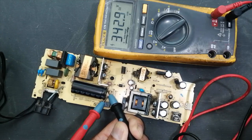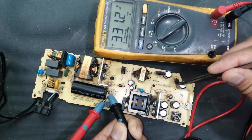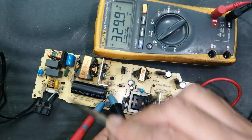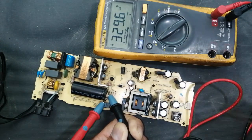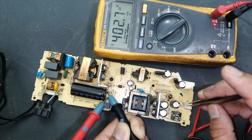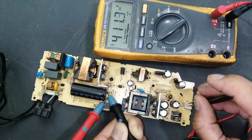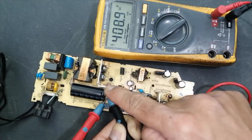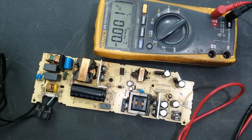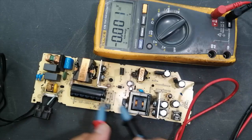Dropping — 370, 330 — because the PFC circuit is now turned off. With the PFC circuit off, we have no output in the 12-volt section. Only the standby circuit is working, and we receive the standard bridge rectifier output voltage. Now I will turn it on again. The PFC circuit started switching and it is now regulated at 411 volts — normally we call this 400 volts. The PFC circuit is maintaining the DC bus voltage at 400 volts.